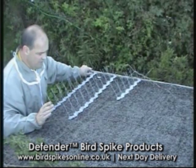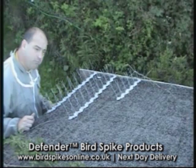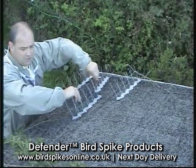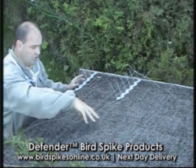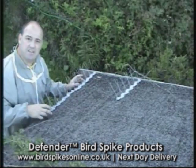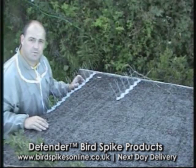Just one thing I forgot there. Sometimes it's actually just the pigeon droppings coming down the fascia of the building onto the ground below that's the problem. In that situation, you could actually get away with just putting the spikes on the leading edge. It still means you're going to have pigeons further up the roof, but at least by spiking the leading edge, you're not going to have any droppings coming down the fascia of the building or onto the floor below.